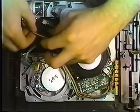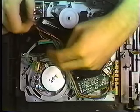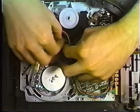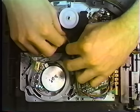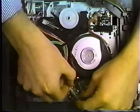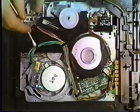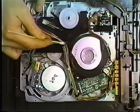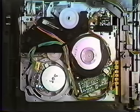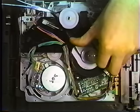Don't forget the small spring that was attached to the cover plate. It's very important that these wires go back into the exact position that they were — a loose wire could accidentally catch into one of the gear assemblies. Now go back and check. We can now replace the capstan belt.